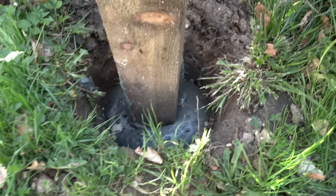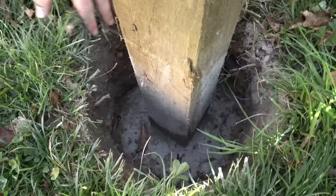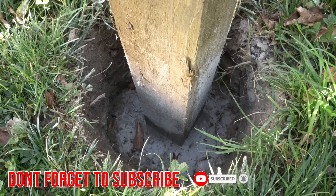If you come over here and have a look at the concrete — you can see in there the concrete has set completely flat. Normally what you'd do is fill the concrete right up to the top of the hole and smooth it away from the post, so any water that ran down the post would just run away from the bottom rather than collect.